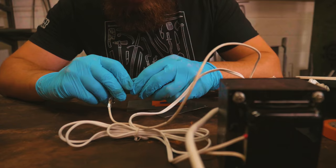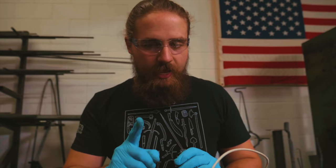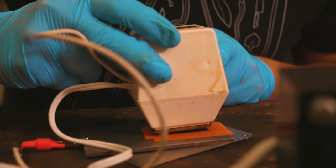I found out that the most effective method for getting the etch that we want will be doing 3 cycles of 8 seconds of deep etching and then 1 cycle of 8 seconds of doing normal etching, which will give us our relief first and then fill that in with that nice black color. So here we go.